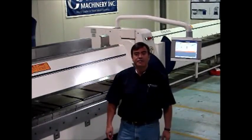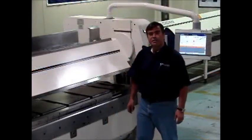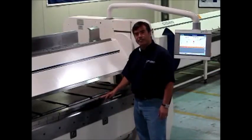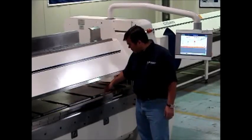We're going to show you the Futura Plus 30 folder. It's an 11 gauge by 10 foot, or 3 millimeter by 3 meter machine. We'll first start out with the tooling. Tooling has three basic parts to it. There's a segment of folding blade tooling here, a segment of lower beam tooling,